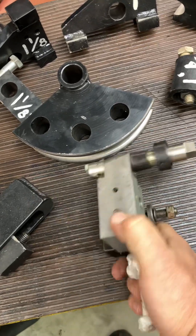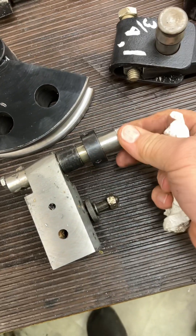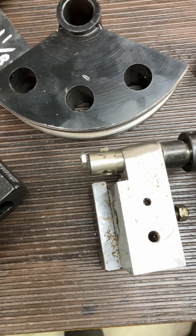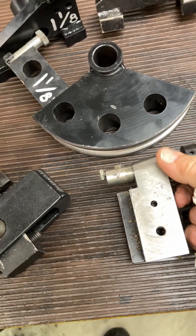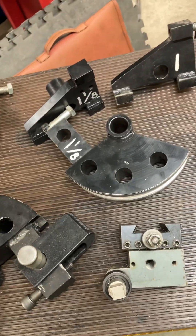It's just this block of steel. I bored a hole in it. I made this shaft with a square on it — you just turn that manually. And the cutter there, there's a screw there to lock the cutter down, but it's all manual. You bump it how you need it to size, and then you just slowly make your cuts and dial it in on the lathe. Pretty simple. You don't have to have the expensive stuff to get the job done.